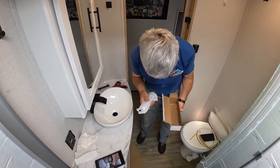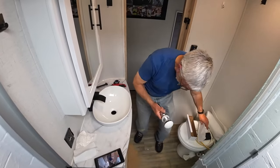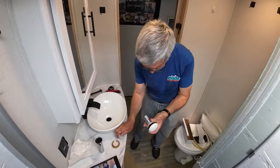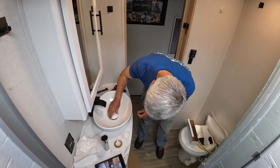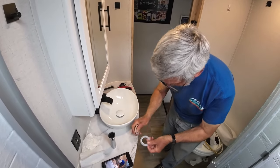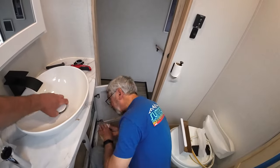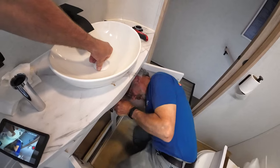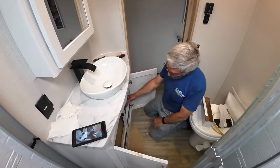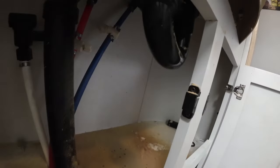In here should be the drain — just hope we can use this drain, because there's no guarantee. Worst case, you can reuse the old one, as long as the tail piece is long enough. It looks like it just slots down in there like that, then back on your knees. I'll hold the top. Okay, just hand tight. We've been able to install the waste line directly from the bottom of the sink into the existing pipework — it's long enough. No cutting, no nothing — just put it in there.